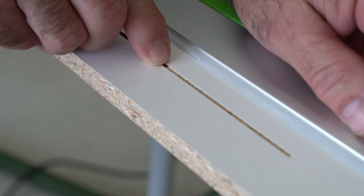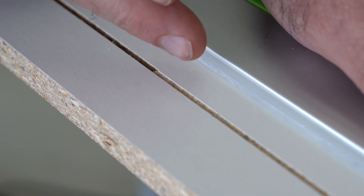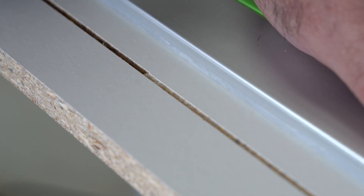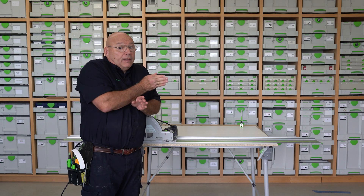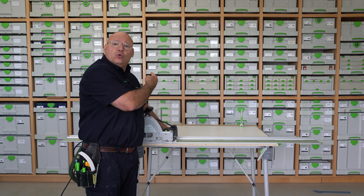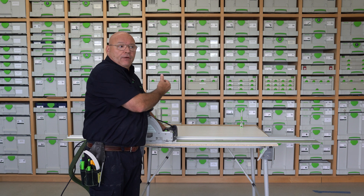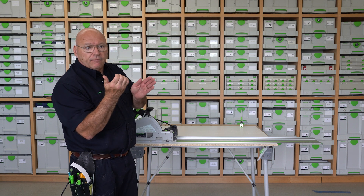Hopefully we can zoom in here and see this, but you're going to see that it's not lined up perfectly — you can see right there. So what we have to do is adjust it this way, and that way is called left, and I'll show you that on the saw. We have to adjust the scoring blade in which the arrow behind here is pointing to L, which is to the left — it's pointing toward the rail. If it was on the other side, R to the right, it's going out if it was off that way.